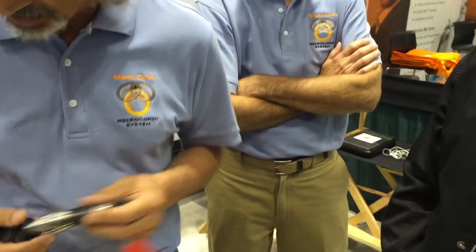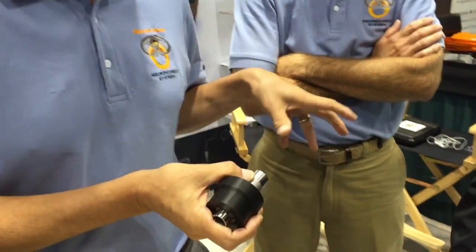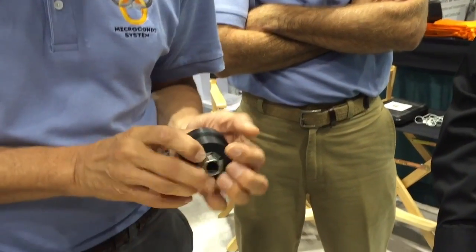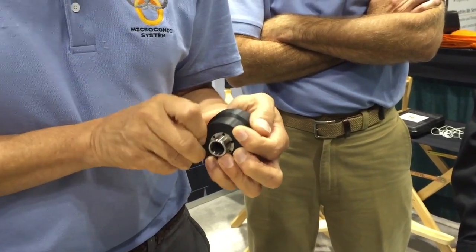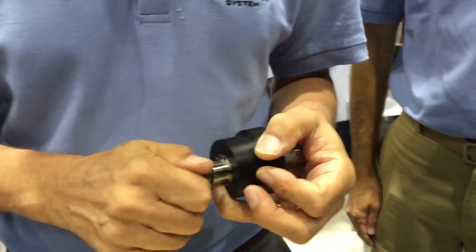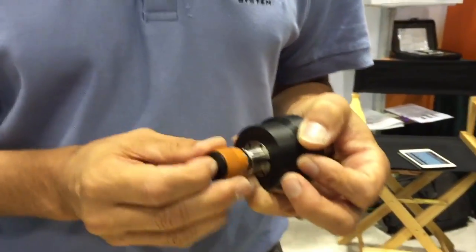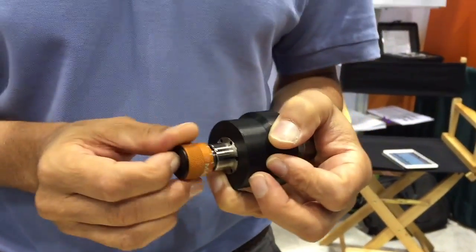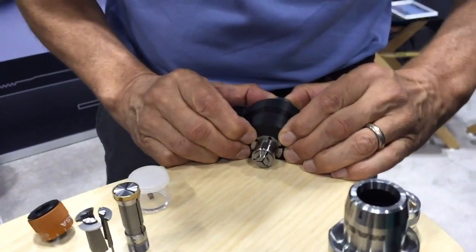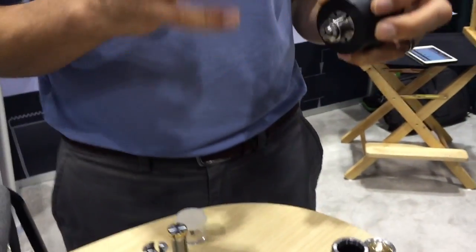You don't even need a workpiece to set the collet — you don't need to do it by feel. The closing of the collet is entirely controlled by the cartridge. The machine actuates it with the open and close feature, but the cartridge actually controls the gripping force. This fits in just like a TF-25 collet. You put it in, set the closure and average force, and you're done. It's true dead length — the collet does not move, just the sleeve.